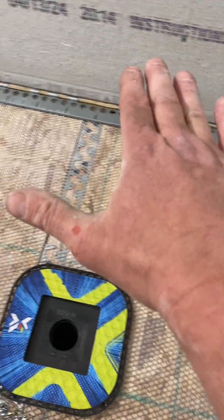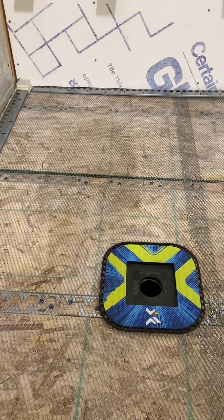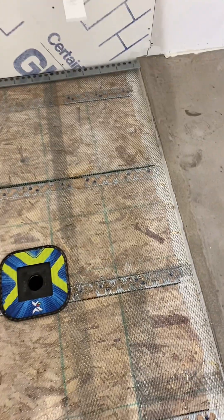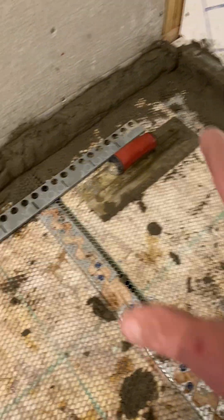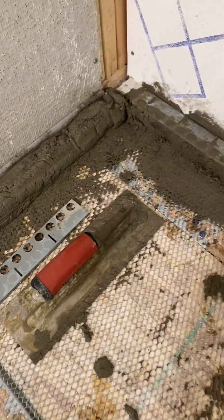When I go to screed this, I'm just riding my edge on something hard all the way around. You're not going to be able to pack it and carve it freehand — you really have to be dragging your straight edge on something hard, or it'll just totally mess it up. I've learned that the hard way. I mix this stuff up kind of stiff because it's usually pretty runny, make a little mound, and press that cap strip into it with my level. Got to work really quick — this is already starting to firm up. I've also used foam board or float strips pressed into it. Basically anything hard like that to give you a hard edge to screed off of.